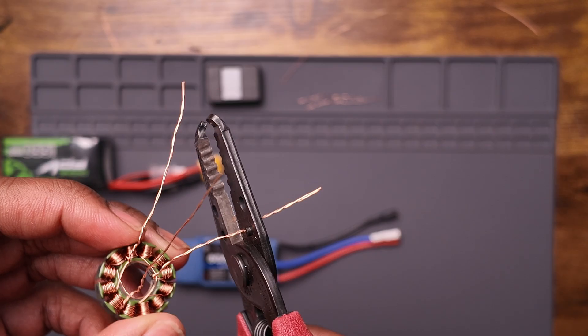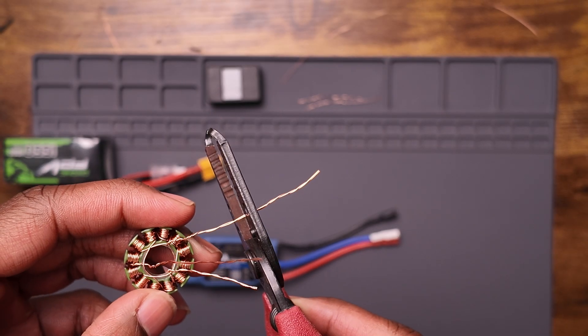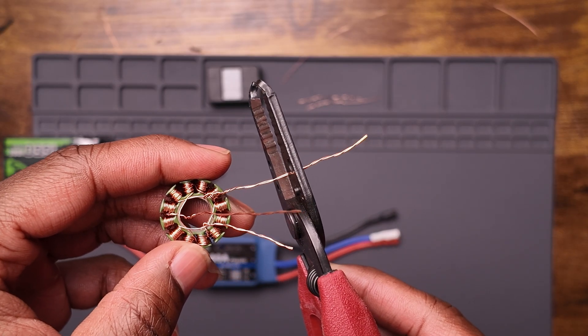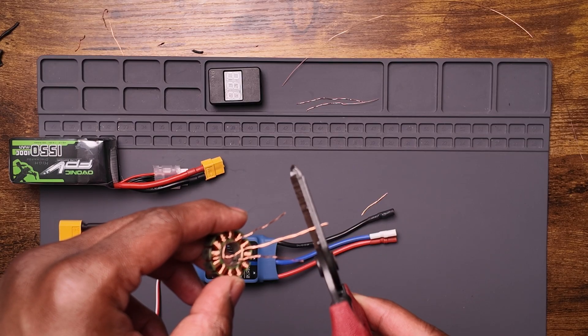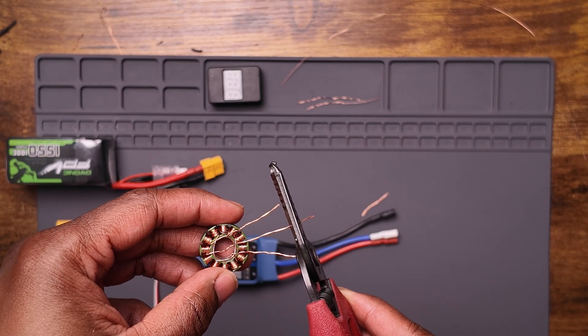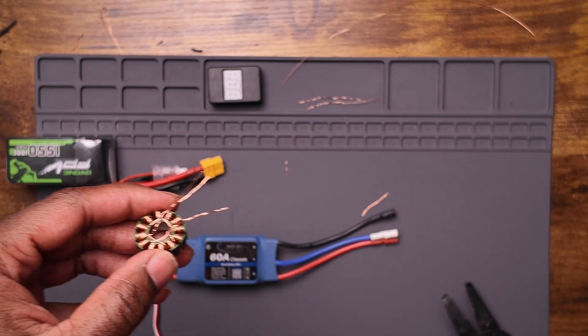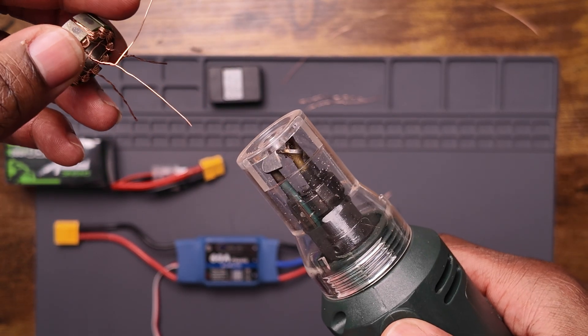Now trim the wire, twist the wire pairs, tuck them under the wire run across the stator, then trim them a little bit more. At this point you should have three twisted wire pairs, and the ends of these need to be prepped for soldering. The easiest way to do that is to remove the enamel coating from the wire. The cheapest way is to purchase sulfuric acid — just dab it on the wire ends and let it sit for a few minutes, about $20–$30 from Amazon.